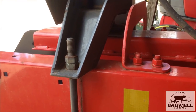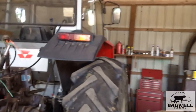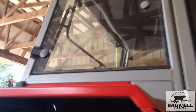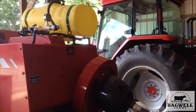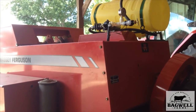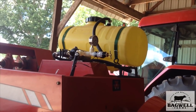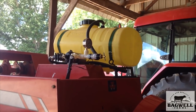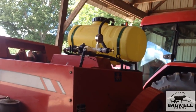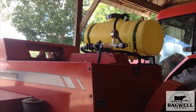I'm also going to buy a moisture reader to go on the bale chamber — it just bolts inside and you run the wire to the cab. They come with a monitor that'll show you the moisture, and then I'll basically have the same system that Harvest Tech sells for $1,400, right on this tractor and this baler — it'll do the exact same thing. If I don't have to adjust the regulator that often, I'm probably going to dump the idea of the electric regulator since it won't be worth running all that. But I am definitely going to get the moisture sensor for the chamber.